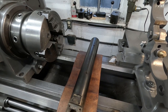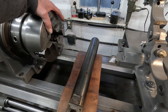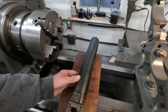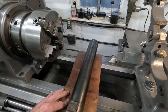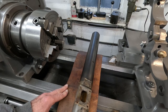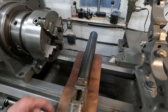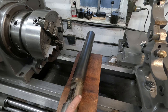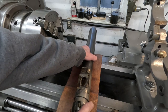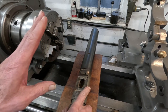This is the way I load things in a four-jaw chuck under this circumstance. I'm sure there's multiple better ways of doing it, but I'll show the way I do it on this antique lathe. I've got this piece here, and I need to bevel the end a little bit for the bull center to hold this, and I'm going to start turning on it. It's heat-treated. This is a part off a plastic mold machine — it's the auger. It uses heat and draws plastic in and melts it. So this is a part that's gotten hot. It's good quality steel. I'm going to see if I can salvage some of it and make a tool out of it. I'll end up cutting this stuff off, but let's get it running in the machine without bind.